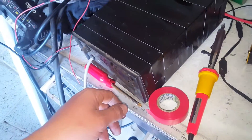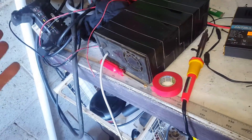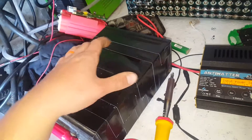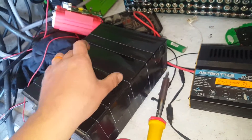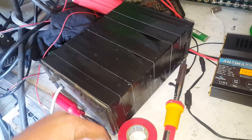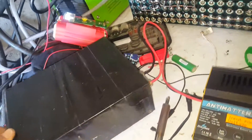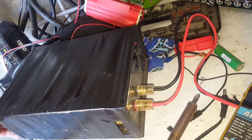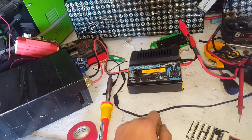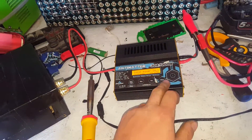It's still pulling 34 amps out of this beast. I've enclosed the case — it was open frame because it was in a stereo sound wall setup. The problem with the open frame was no air draw in the front. There are a couple of big heat sinks on the MOSFETs, so I left a little gap in the front each side for airflow, which will help keep it cool. It's a 40-amp 13.8-volt switch mode power supply — quite an epic device. Coupled with this charger it's excellent. Those leads aren't even getting warm.